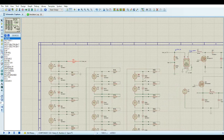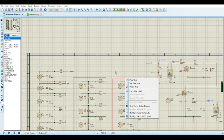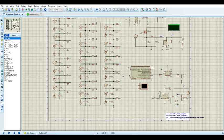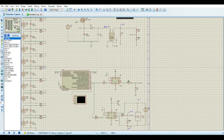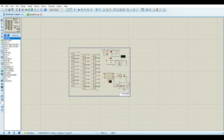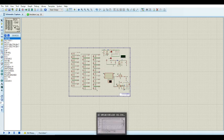So this is essentially just to give, so we could test the MPPT charge controller feature on this. It can't really be done with just a fixed voltage or fixed current source. It's better to have something like this that actually changes its voltage and current like a solar panel would. And that's the solar panel, and those are the converters, obviously driving everything. But this is just a simulation, to be honest. All right, that's it. Now I'm just going to get into the other aspect, which is the code.